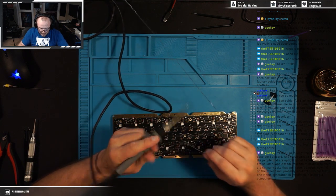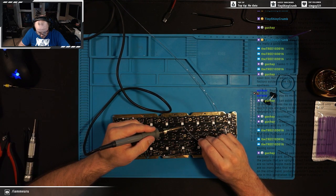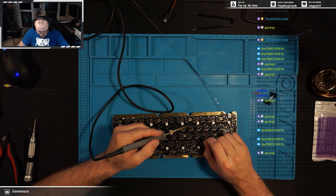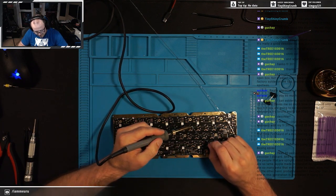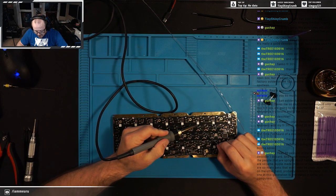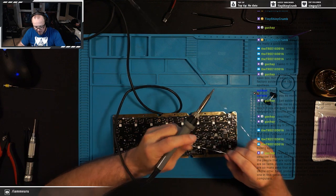And the big problem there, guys, and this is why you should pay attention to your soldering methodology: when you solder components onto a PCB, even if they're through-hole components, I repeat, even if they're through-hole components, please, never, for your own sake or the sake of whoever has the board after you, ever bend the pins on the back side of the PCB. Always leave them straight.